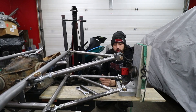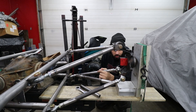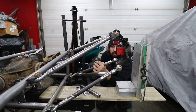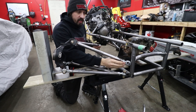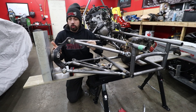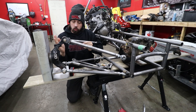We're at 0.23 degrees right now, and if we go up — yeah, it's negative cambering out when it goes up, but very slightly. We're at one degree there and two degrees all the way up. I did learn something from this test: if we move this upper control arm down to somewhere around here, we actually get the camber we're looking for. We're going to have to extend the arm a little bit, but as it moves through this radius it does want to camber in.